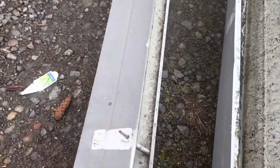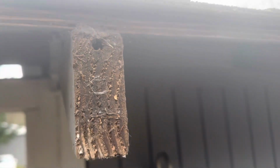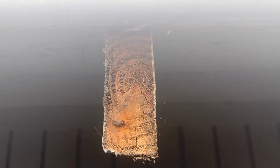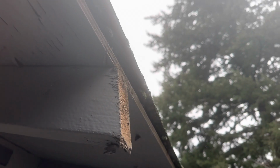All right, so let me show you the spike and ferrule. But look at the big hole that spike makes. And every time there's hot, cold, and water, these will come loose. See, this one never got hit. It's good. But all these, you can see the water marks and stains. See, fresh here, wet here, fresh here, wet and rotten here. So you can see the pattern everywhere where the nail was. And no flashing either, because the gutter came with its own flashing here, you can see.